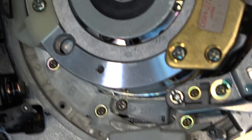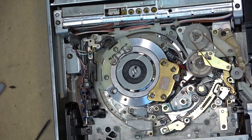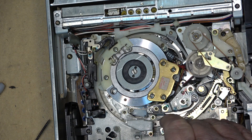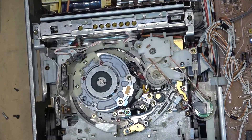Check the switch at the back as well - those are the two main switches on this specific mechanism. There is another variation - I'm going to grab one of my own machines to show you. Some of them use a tape end sensor over here - a coil that gets moved by the pinch roller when it's in the unloaded position to signal the unloaded state, as opposed to a mechanical switch. Here's another variation on the 711b - I believe this is the 711b2 chassis.